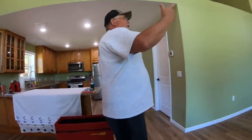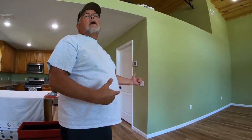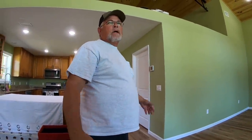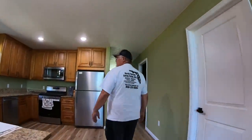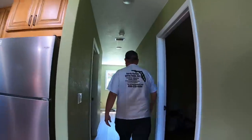If somebody went up in an attic and busted a hole through there and ran a wire without sealing it — we run into that all the time. I actually did that the other day for a repeater, but I went right behind and foamed it back as tight as I could get it.